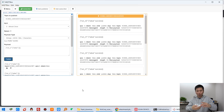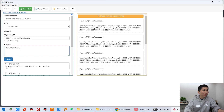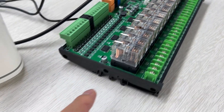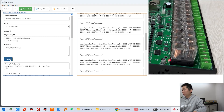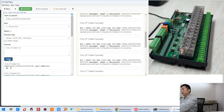For RF signal: copy the RF MQTT command for ID 1 and paste it into MQTT Box. I will send this signal to the wireless receiver module. Watch relay 1 — I press publish and you can see the relay turns on. So this RF signal is sent via MQTT. I press publish again and the relay turns off. So the first learned RF signal ID can be sent to the receiver module. This is how to use the ESP32 to send RF and IR signals via MQTT. Thanks for watching.